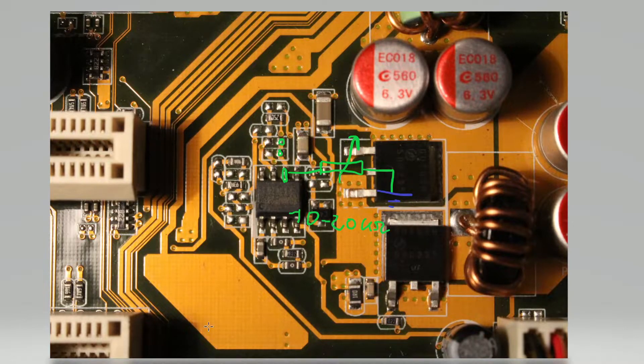You don't want to raise this voltage by too much anyway. Unless you're going for FSB records, probably less than 1.8 volts. There is no switching frequency mod here because this is a fixed 300 kilohertz controller. For ground points I'm not sure which ones are in this area, but personally I use a screw hole on the bottom beneath the I/O. You can also use the casing of any of your I/O ports. If you want to use a capacitor ground here in this area, the big one should be ground on top — so this one here is ground.